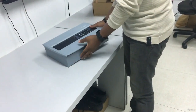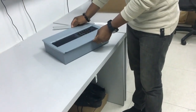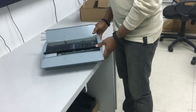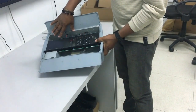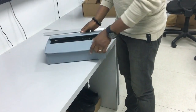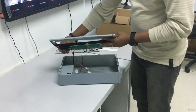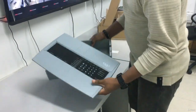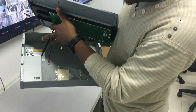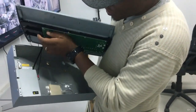This is the fire alarm panel — it's as good as new. You can open this compartment like this and then open the compartment — you have everything inside. Now these are the zones, then the sounder zones, and then the smoke zones — we'll get to that. You can remove this for the first installation. Now if you look in here, you see neutral and live — that's where you have the mains power supply. And then the earth cable is in the middle, right in the middle here.